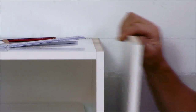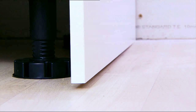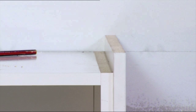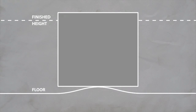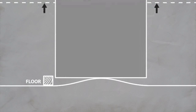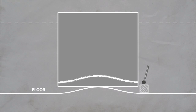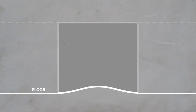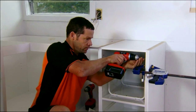Time to fix our end panels onto our unit. This end panel is 25 millimeters too high, so we have to trim the bottom edge, matching it to the up-and-down contour of the floor. Put the panel into place and clamp into position, level with the top of the cabinet. Measure the distance above finish height — 25 millimeters in this example — and cut a matching 25 millimeter block. Set a pencil against the top of the block and slide along the floor to scribe a line matching the contour of the floor. Simply cut to the line, lower the panel into place, and screw into place.